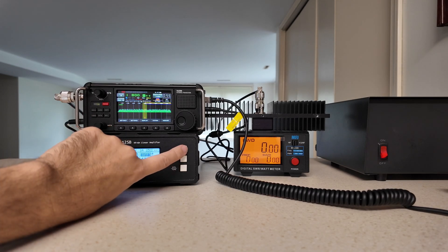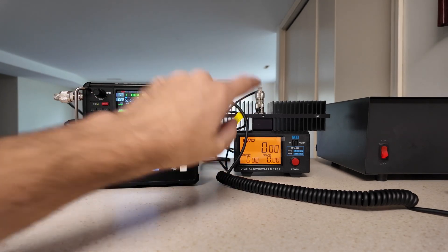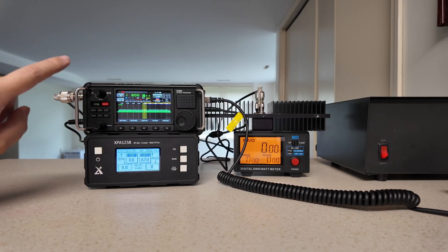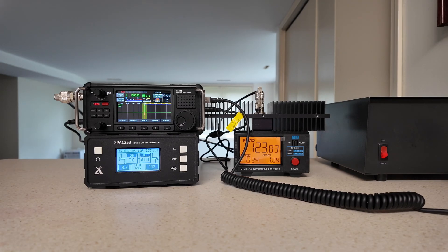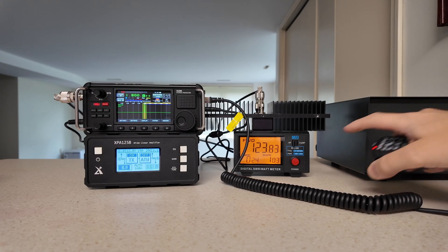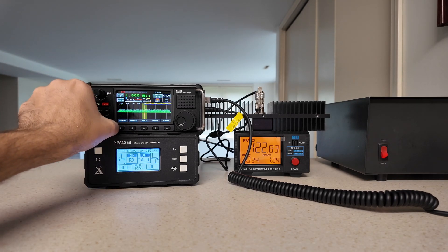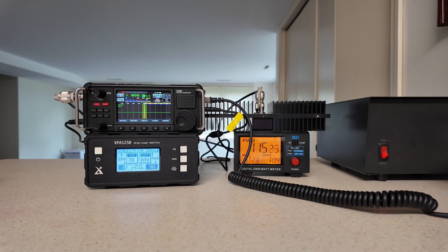Now I want to turn on the amplifier. This amplifier is supposed to have a whole bunch of protection circuits built in, and with the L4001 cable it should communicate back and forth to the radio so the radio won't overdrive the amplifier — because the amplifier cannot handle eight watts in. Let's see what happens when we key down at eight watts. The amplifier seems not unhappy, but not the happiest in the world, and we're putting out 123 watts. It should be complaining and backing off the power, but it is not. So let me turn the power down on the radio to five — we're at 118 watts external, 102 watts from the amplifier at 4.7 watts of drive. Fantastic.